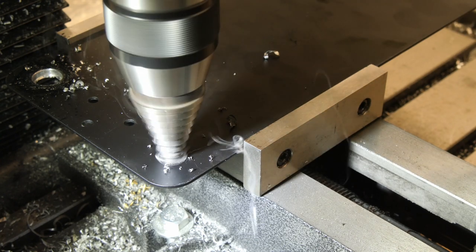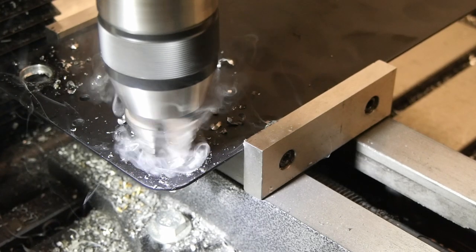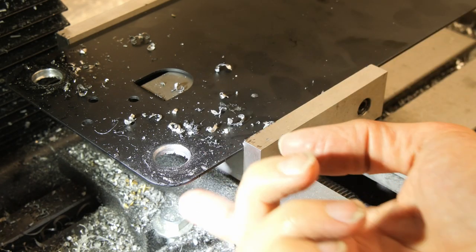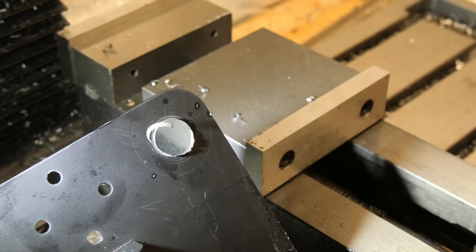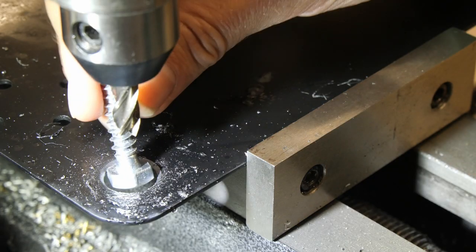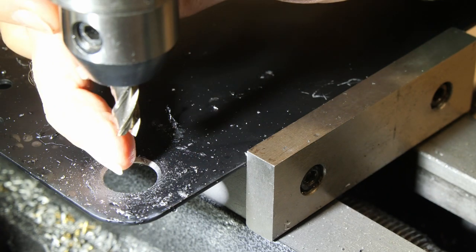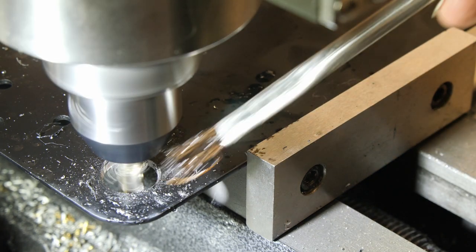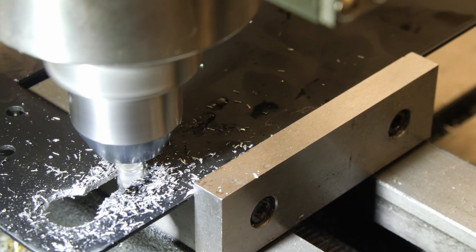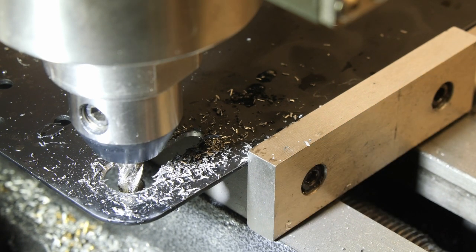Okay, now I'll drill the next one. I've got my holes drilled but there's quite a burr on the back side so I'm going to flip it over and deburr it just with a hand drill. Now I'll mill the slot so the bolt can go through and then the bracket can slide down onto it — I'm just going to go down the center of the hole and then cut one inch. There we go. One slot done, three to go.